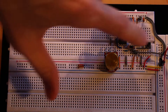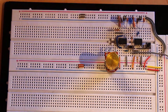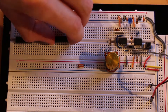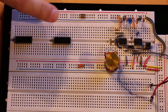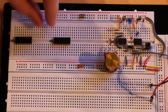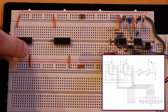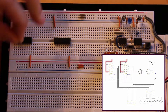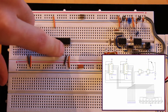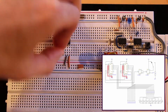Here's where we left off last time with our two 555 circuits — we have a working clock. I'll unplug power and build the program counter on this half. First, let's get the 74HC163 chips in place. I've placed them far apart because the outputs are up top and need to swing back down through the center. Power is pin 16, ground is pin 8. Pin 7 is the count enable — pull it high so the chips can count. Pins 6 through 3 are parallel load inputs; we're not using those, so I'll tie them all to ground.